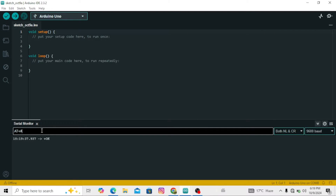Now we will set the address of the transmitter module. Each LoRa module needs a unique address. Use this command to set the address: AT+ADDRESS=1. You can also set a network ID, for example: AT+NETWORKID=5.